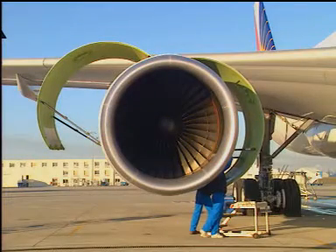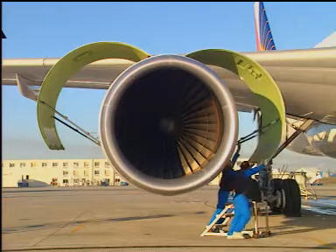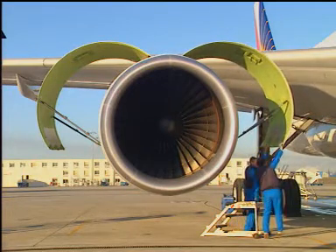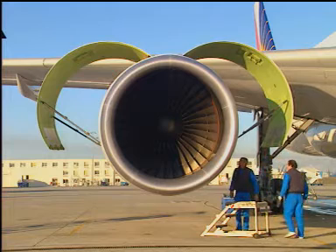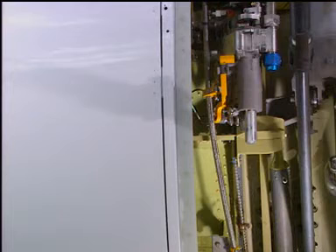You must first follow the safety precautions and prepare the aircraft to operate on engines. The fan cowl doors have already been opened. To apply this procedure, refer to the aircraft maintenance manual procedure. Warning: you must deactivate each thrust reverser half to make sure the thrust reverser system does not operate.